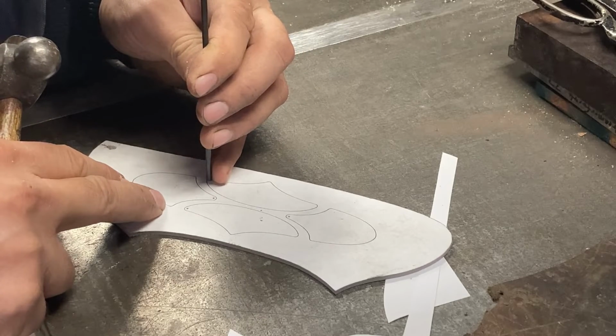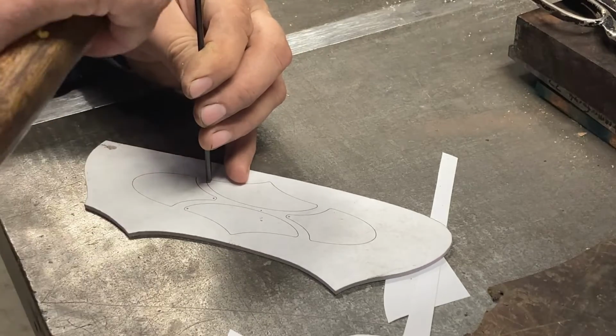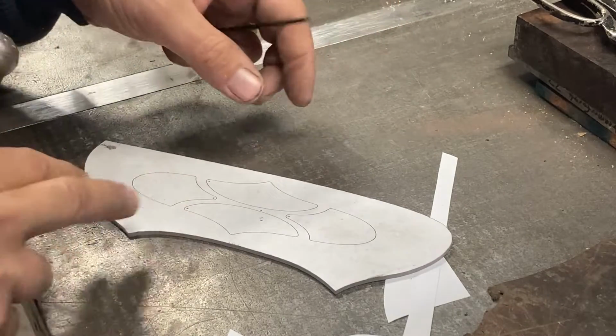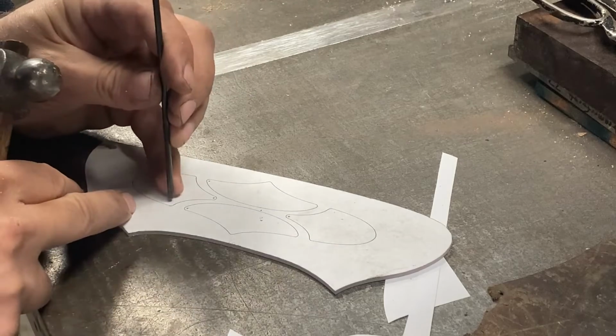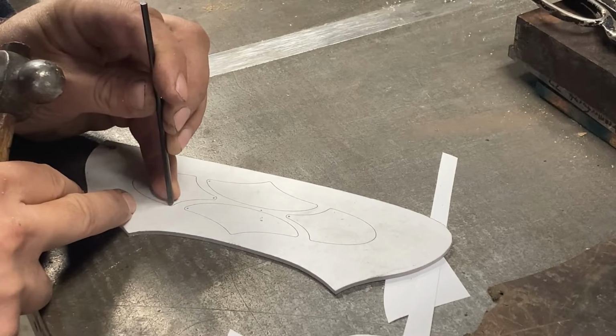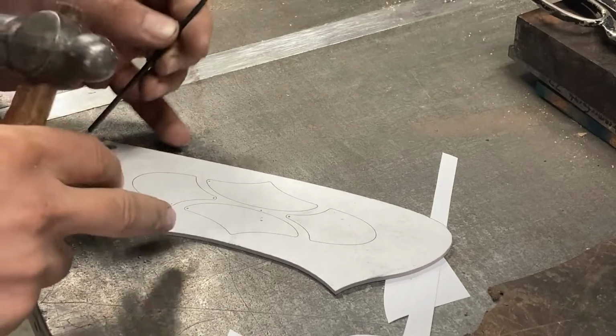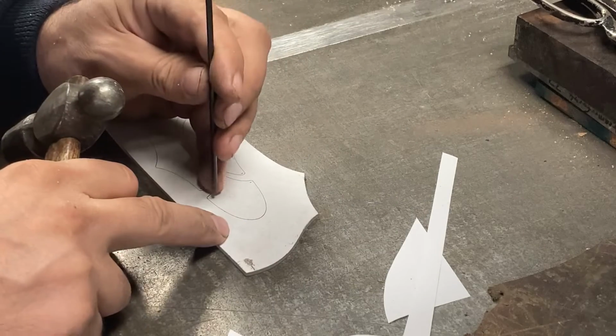And then I won't really have to mess with finish shaping the inside radius of these holes when I'm finishing up making the pattern negative here. We'll just use what comes off the drill bit.